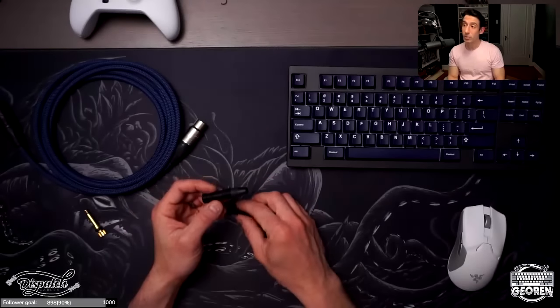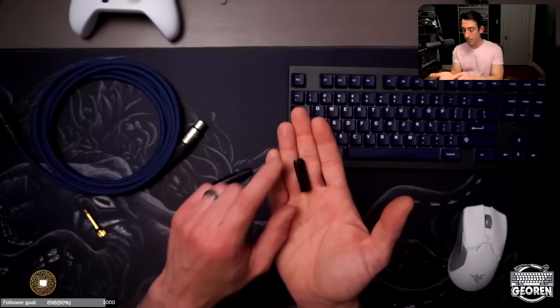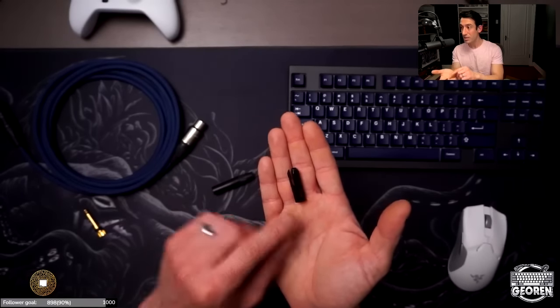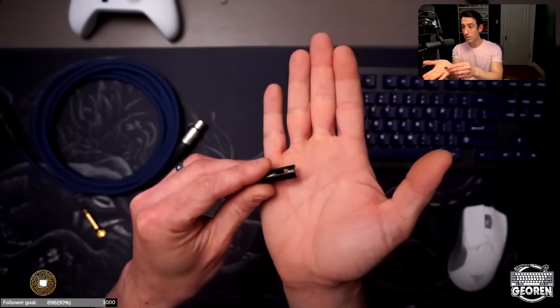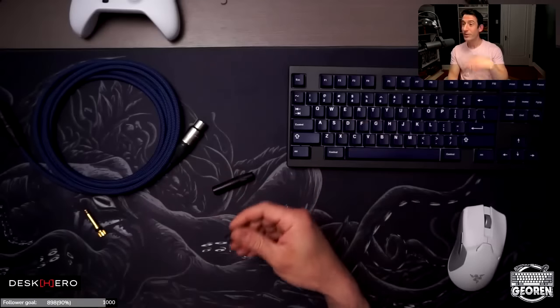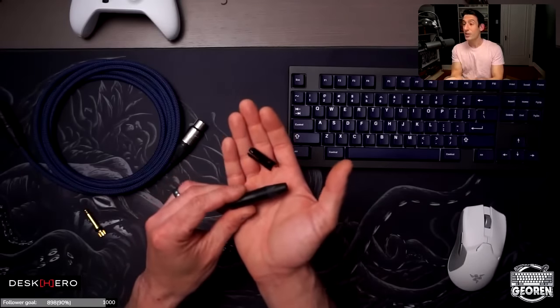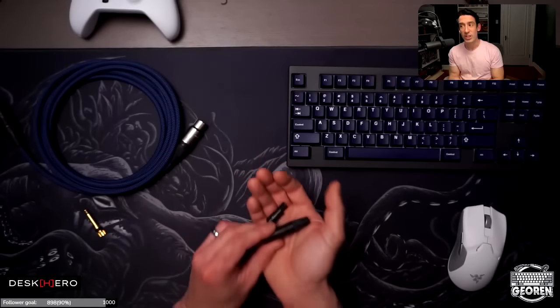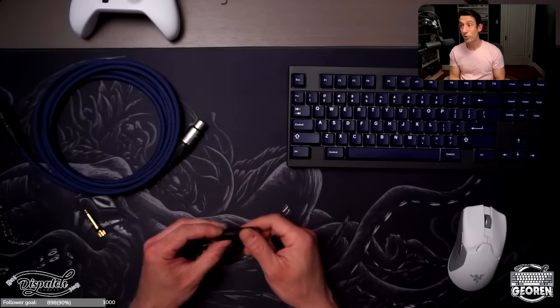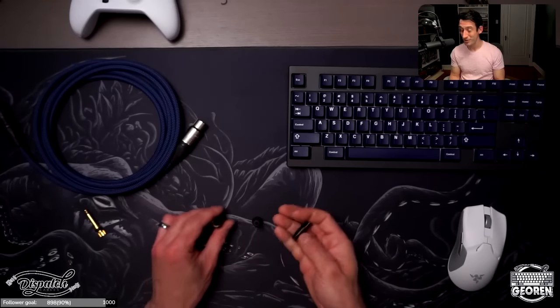The reason why it didn't work is because the wire I was trying to put in exceeded the maximum threshold for this piece when it wasn't clipped. Clip it, it seats a little bit further, allows the wire to get pushed in a little bit more, and then the housing closes completely. Genius mechanism, so simple, totally missed it. Guilty of not having read the freaking instructions.